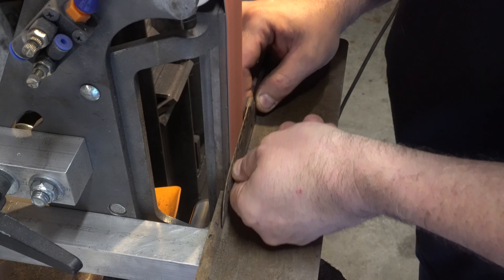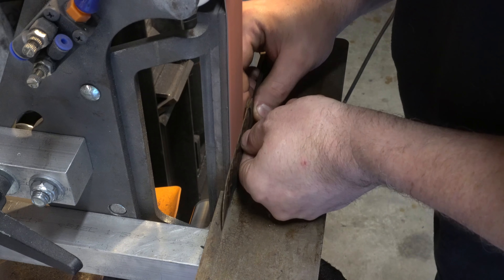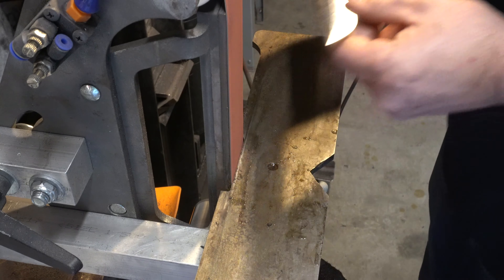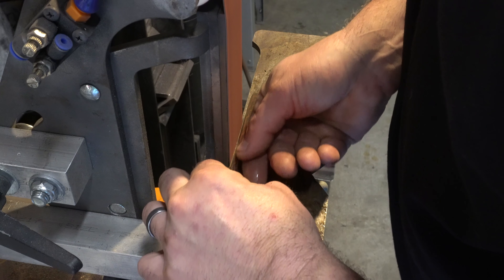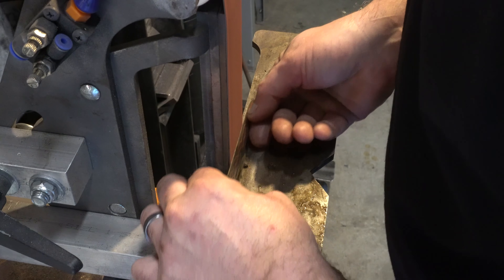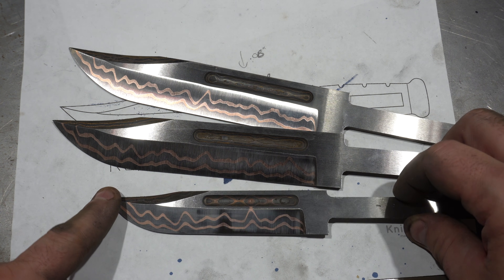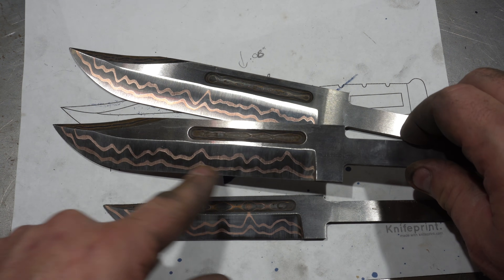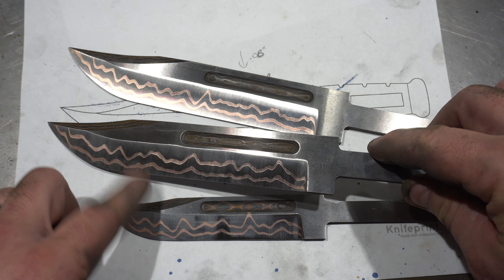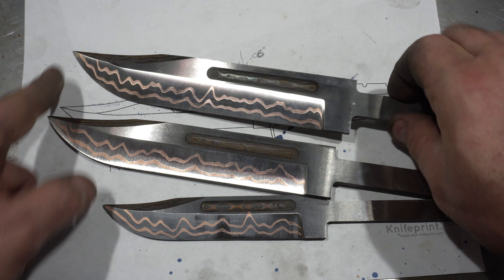I'm starting with one of Brodbeck's 120 grit revolution belts, then moving up to a 240 grit game changer belt. I'm continually comparing the copper on either side just to make sure the bevel is centered. These came out perfect. Here are the blades after final grinding, all the way up to 240 — I've done the flats as well. For those who commented on the Instagram post after I did the initial bevel and saw copper on the edge: that always happens because the edge was the thickness of a nickel. Now that they're final ground, the copper is not on the edge. These look pretty good — I'm pretty happy with these.